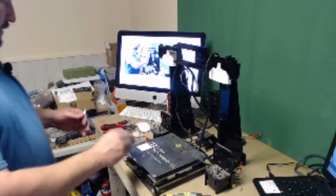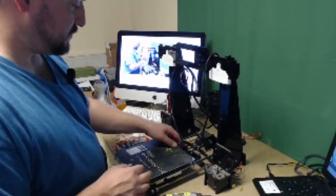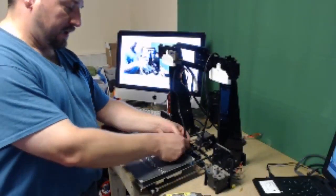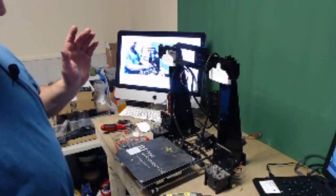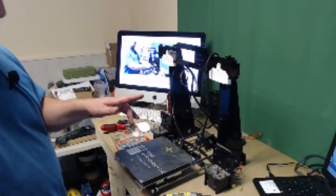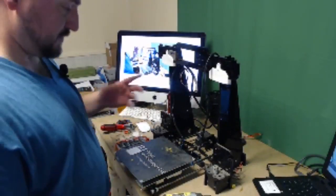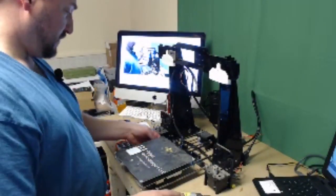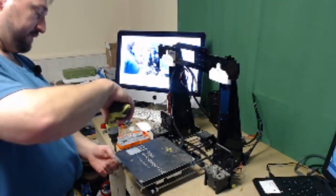I had to resolder this build plate. At one point when it was running in the house, this connection here had melted on the black, completely melted. The printer did not recognize it as a thermal runaway, and it stayed at temperature. Thankfully, I was in the next room, so I could smell it. I'm not really concerned that it was going to catch on fire, to be honest, but it certainly made a little bit of a smell.